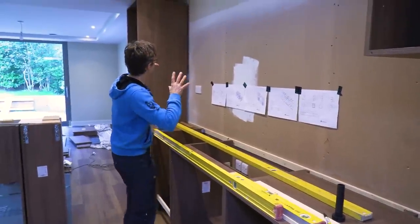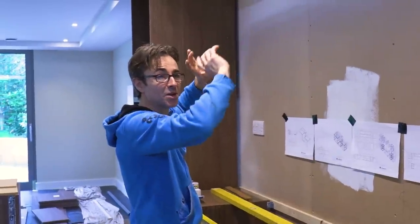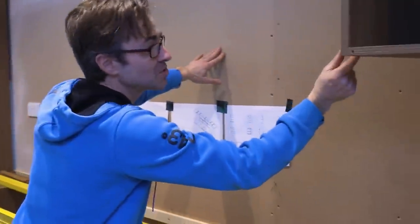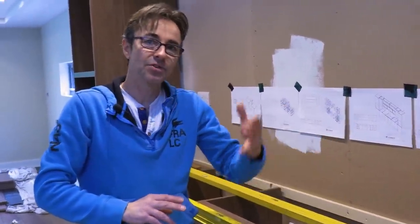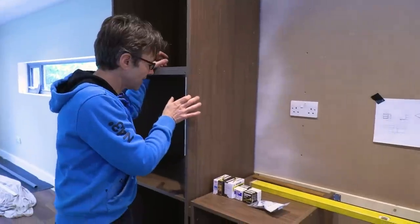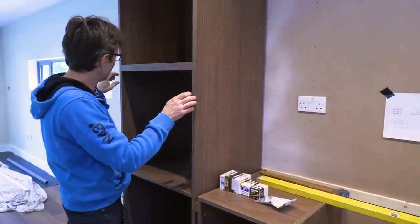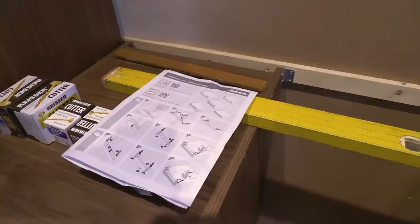I infill the wall units, and I've got an open shelving unit here that has a painted front frame, so there's a special gap between units to allow the thickness of that front frame. If it was a modular kitchen from one of the big manufacturers — Howdens, Wrens — I couldn't really use a traditional in-frame shaker. So this is a modern shaker: it's still got a shaker door, but it's a lay-on door. Blum have brought out a brand new color of hinge which I'll show you later — really nice.